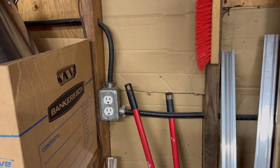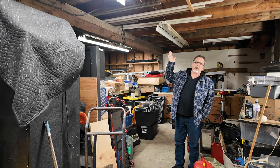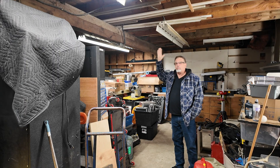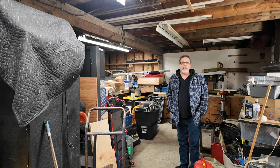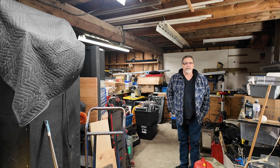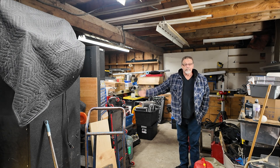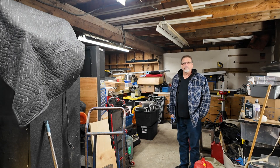I just thought that was an interesting side note. One of the main things I need to get fixed in this shop is the lighting — two of them work, two of them don't. There were some extra bulbs kicking around; I tried them out and they didn't work. I went out and bought these fancy LED eight-foot T12 tubes — they didn't work either. Two are lit up really nicely, two don't work at all. So I ordered ballasts — I'm going to swap out the ballasts and see if I can get them working.